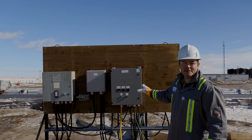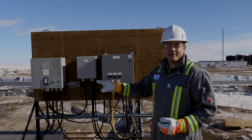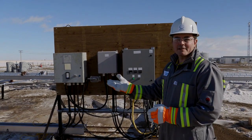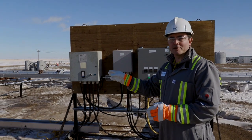This is the electrical control system, which controls everything you've seen so far and also the heater temperatures. We have some preset temperatures that we like to operate the membrane within, so it preheats the syngas beyond the compressor and then feeds into the membrane, which is also heated.